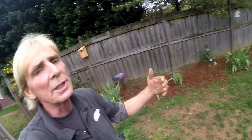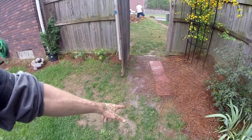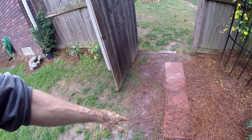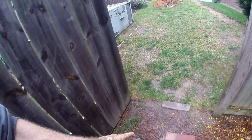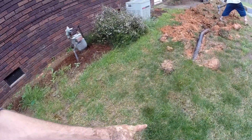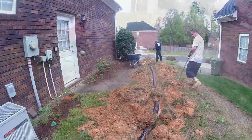You can see this hill in the backyard — that water comes down and just stands in the yard. Someone added a couple of catch basins, but unfortunately they didn't put any gravel or perforated pipe in. That's why the water stays there; if there were gravel and perforated pipe under the ground, the water would have somewhere to go. They ran their air conditioner condensation line over to the second catch basin, and that line ended right there, so we hooked up a new pipe running all the way out to the street.